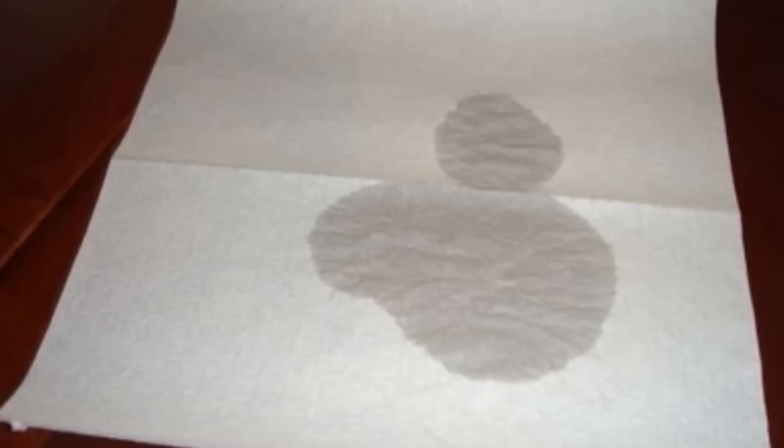By the ocean, that map goes haywire — the salinity of saltwater increases what's going on below it. Think of the counterpoise wires on the ground like a paper towel absorbing — they're connecting, they're coupling. Those counterpoises couple with the earth, which is why I separated this from raised radials. It's using the earth as part of the counterpoise as well. The better you couple to it, the better off you are. Some people use screen or other materials to couple with the earth, and that coupling effect increases your dB gain, as I showed in the chart.